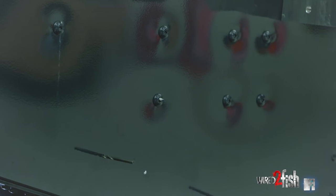Just a quick recap of what we did: we unboxed our sonar unit, mounted our transducers, strung the transducers through the boat, strung a power cable through the boat, hooked everything up, did our fuse protection and cable management. Now it's time to hit the power button and see how we did. We've got power to our head unit — it's powered up. We'll go through the setup process when the menu prompts us. From start to finish, that's how you install your fish finder.